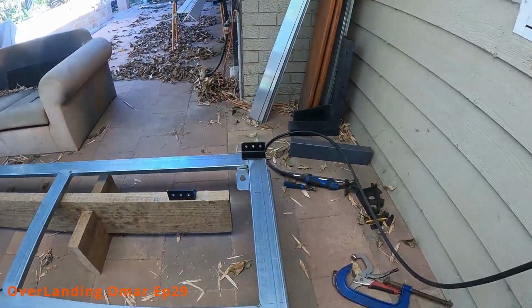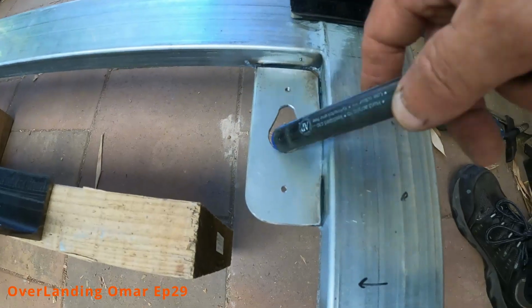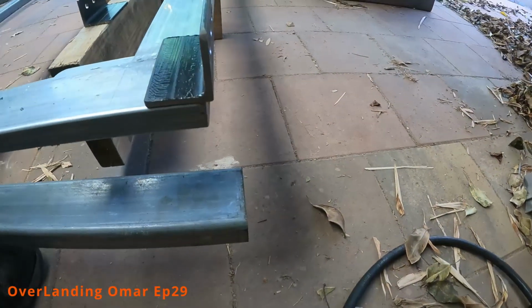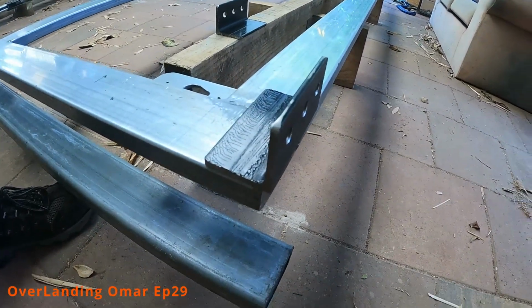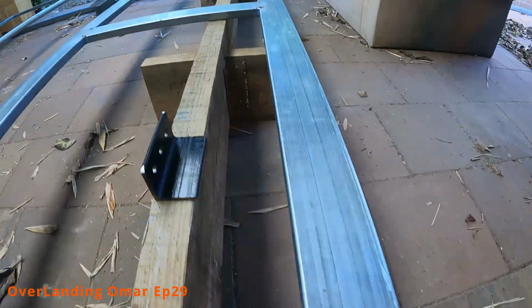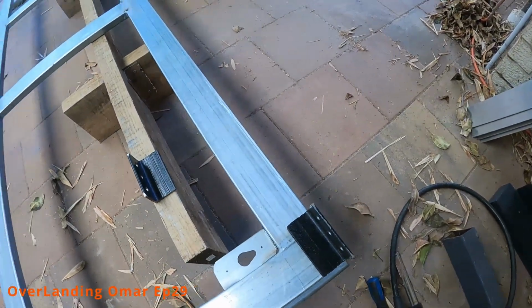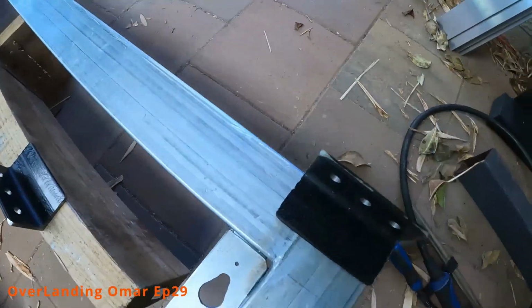All right, let's go and find those brackets. So the car's been turned over. That's the light-fitting bracket. And this is the tie-in for the top of the bow to match the rear one. There's the other one from the corner. So I'm just going to mark out where the end is. I need to grind the gal off to weld it.